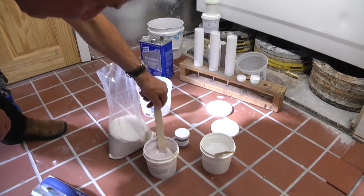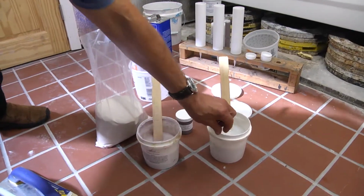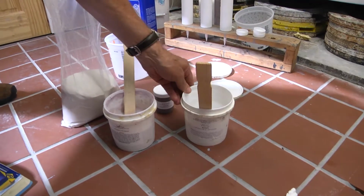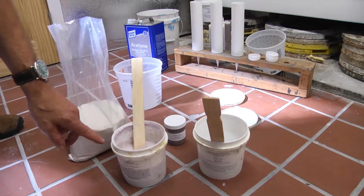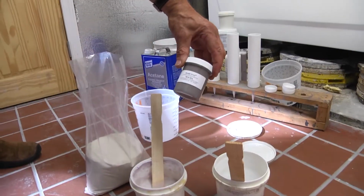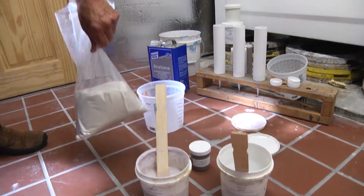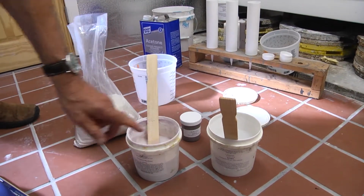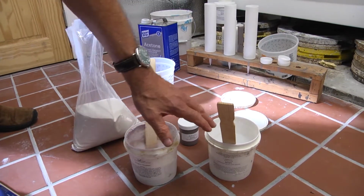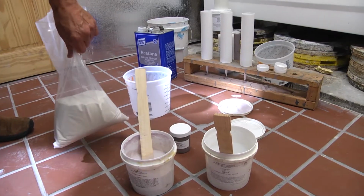The next material we're going to use is our Marcoat General Service. It's a 1-to-1 water washable epoxy, hardener, resin, 600 mils, 600 mils. We have custom colors. This one happens to be mocha. And we have our bag of sand that fills this entire kit. So it's 1 part resin, 1 part hardener, 1 part pigment, 1 part sand.